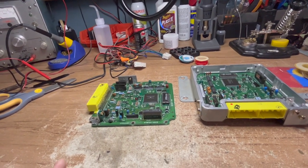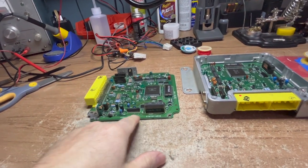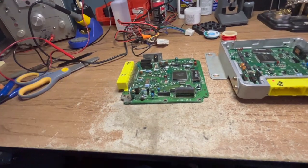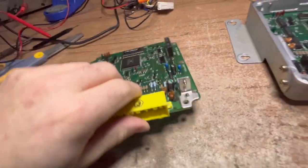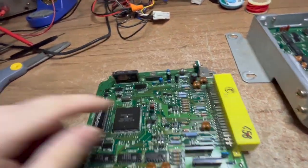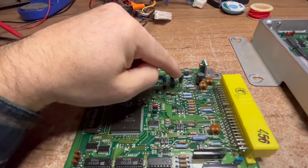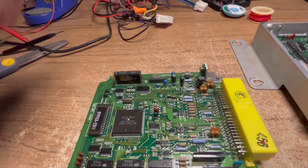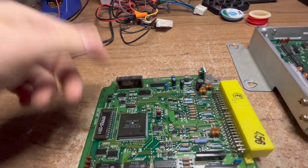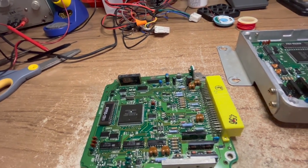The problem is the ECU isn't bad. It's the power delivery going into the ECU, because the ECU has its own power filtering and regulation section right over here. The problem is these three little caps - these are capacitors. There are three different values. I'll put the details in the description of this video, and I'll show you where you can get the parts.